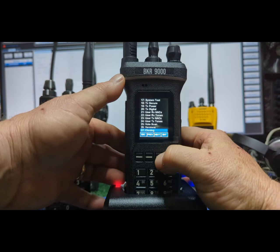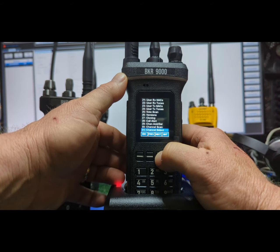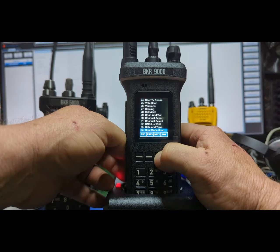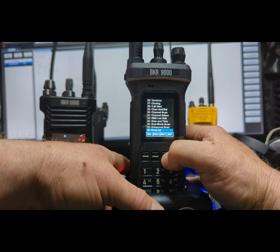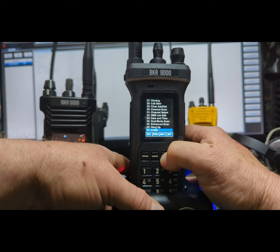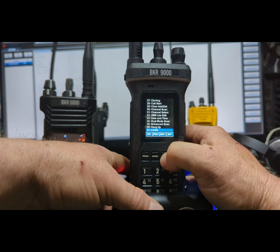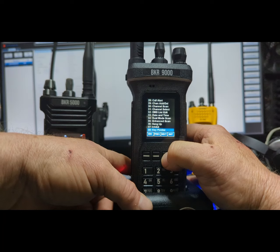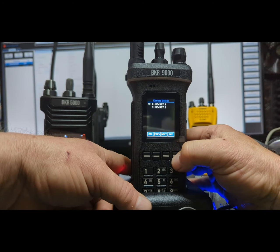Every less than one second, even if there's traffic on another channel, it's going to jump back to my priority channel. If I want to change my priority I just change the channel. The menu remembers where you were — that's also really cool. Date and time. Dual mode scan — some stuff for real geeks. Enhanced scan — that's what I recommend. Hang up — like a grounded mic hanger, most people don't program that. Inhibit will keep it from transmitting. Key pick list — I have my keys in there. You can have a key store, two different key sets — I think like 64 keys in two sets.